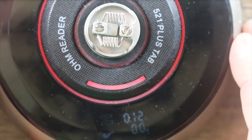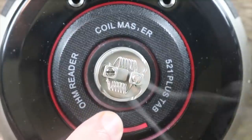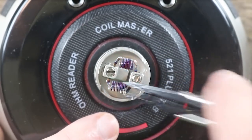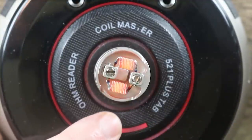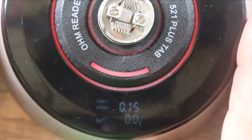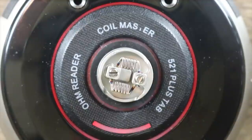Let's put this on a build stand. We're coming out at 0.12 ohms — that's probably going to change. Let's make sure we got no hot spots. We got a few coming around — let's scrape them out. There we go. Oh yeah, that's looking good — glowing evenly from the inside out. Now you can see after the coils cooled off we're down to 0.15, which is exactly where we should be.